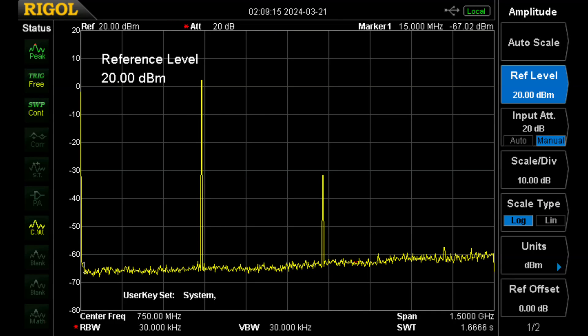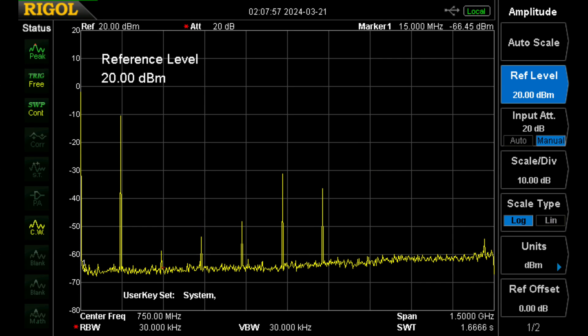I put this thing on the spectrum scope — I used it with my spectrum analyzer. The 70 centimeter band is great in terms of harmonics. The two meter band has lots of energy in the harmonics, but not so much as to take much away from the energy in the two meter band. I think we have about 30 dB down — 30 dB down is one thousandth of the amount of power, so almost all the power goes into the carrier. I tested a radio once before where there was more power in the second harmonic than in the fundamental — that is not the case here.